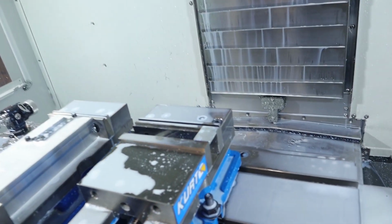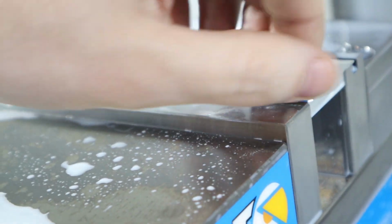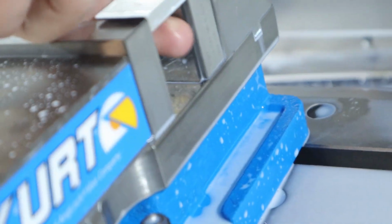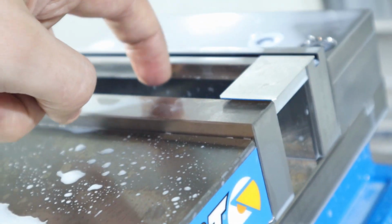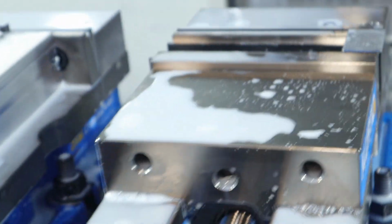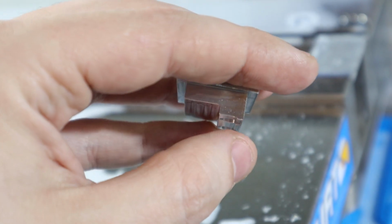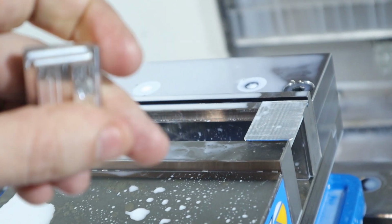Pro tip, so I put the G55 point in the wrong spot. See, there's this hat on the part left. Obviously there's supposed to not be a hat. I set the bottom point to the parallels. Well, the bottom of the part is not resting on the parallels, the lip is resting on the parallels.